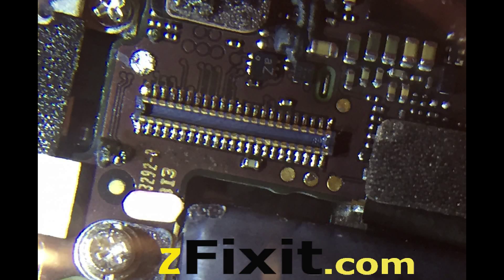Here's a picture of the final product. As you can see around the chips, there is additional solder — very shiny, looks good, no shorts. Some of the areas might look like they're shorted, but there are no shorts. There's still a little bit of alcohol left, so I just need to let it dry out. It's kind of hard to avoid getting solder on those test points — maybe cover them with Kapton tape.